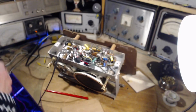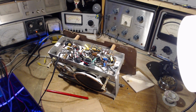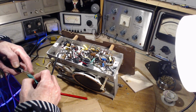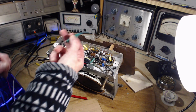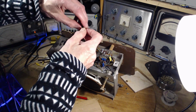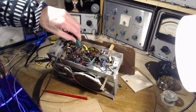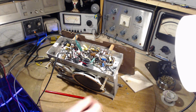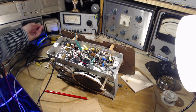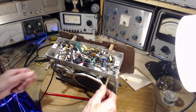Let's tune the radio and watch that vary. I think that's a good approach. Let's see how it changes. Get a different clip lead this time. I thought before I determined that hooking up the voltmeter to this point didn't affect the radio. Sure seems to now. Okay, once again, right spot. Five volt scale. That's the volume change.